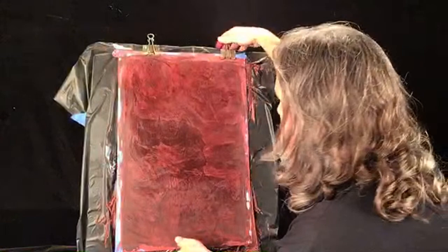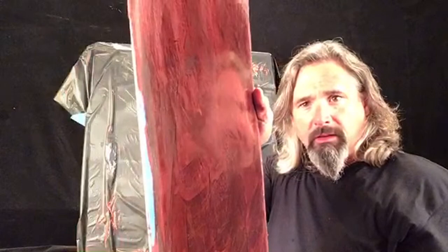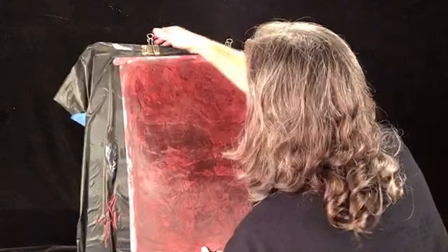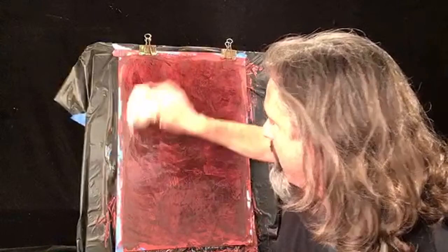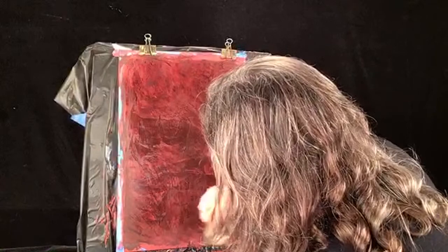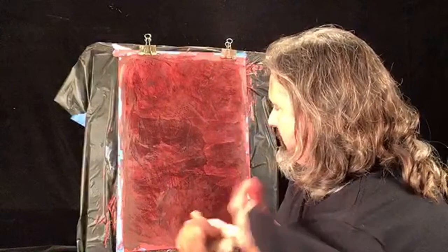Let's stop here so we can see the difference between the top and the bottom. My orange peel wall — do I skim it out with basic joint compound before the quartz primer? Yes. Feel that shine — and that was just that quick. Do I let it sit overnight and hit it with the buffer? If you use a car buffer, be careful — it can burn through the wax really fast and mess up your plaster. Don't try it your first time out. Also, a colored t-shirt — because it's a soft base wax — can pull the dyes out and mess up your finish.